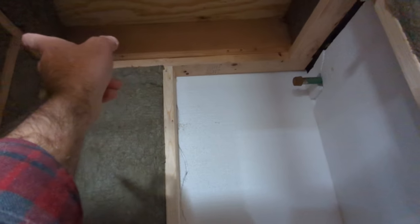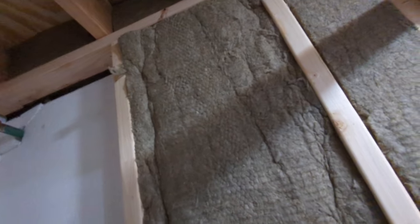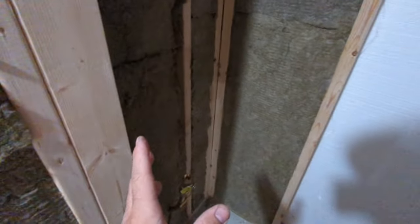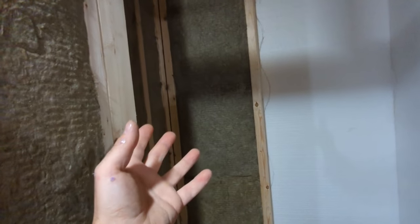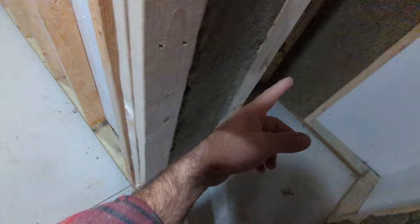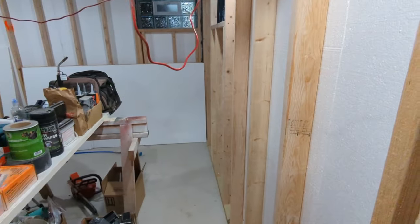So you got water, you got gas. We're going to go to the left and exhaust out through the rim. And we'll go to the right and that'll be the inlet for the air that the machine uses. So, last thing is we've got to get condensate, the water that falls out of the air, because the combustion of it generates water. And then I would like to passively drain that through the wall over into the stack. So there's a chance of that.